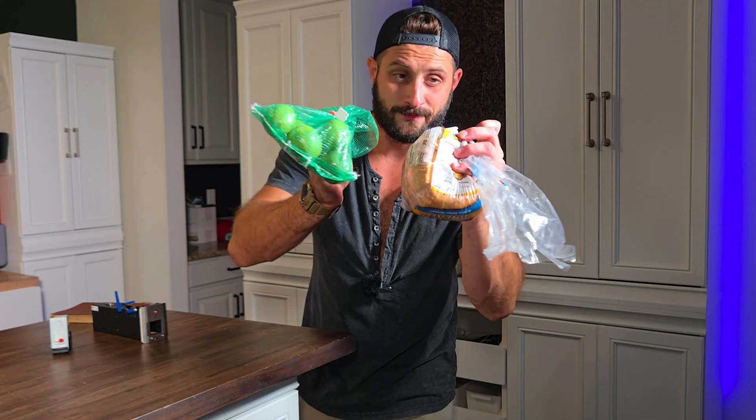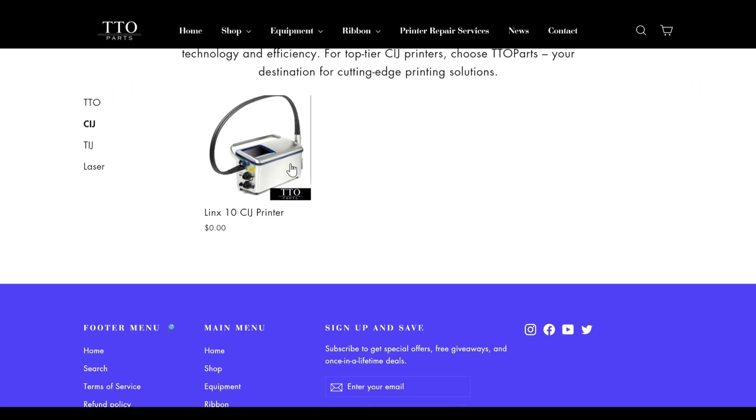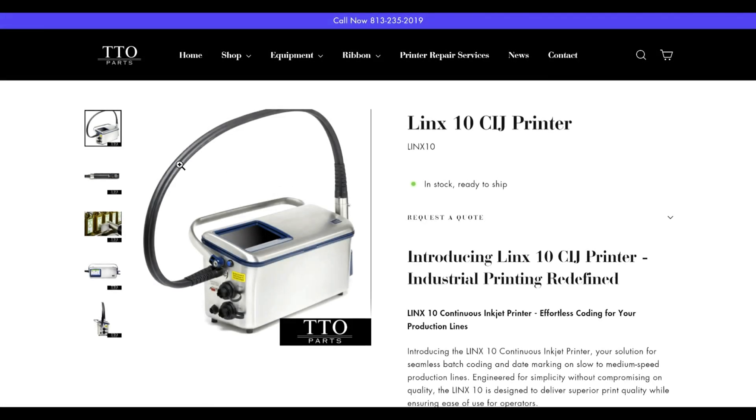What was this nightmare of a material that I was printing on? Quick lock tabs — you might know them as bread tabs or produce tabs. After running into this predicament, I ran to the grocery store and went down the bread aisle just to see what other people were doing. And 99% of those tabs were marked with CIJ printers — a different style printer that uses a quick-drying solvent, an MEK-based solvent in most cases. We have CIJ printers available and could have ended the whole project right there. However, price was an issue for this customer.